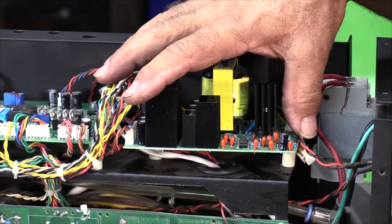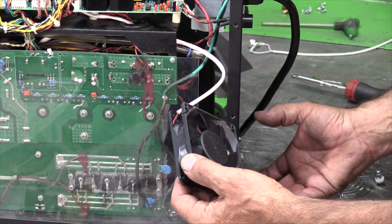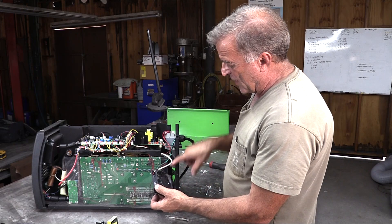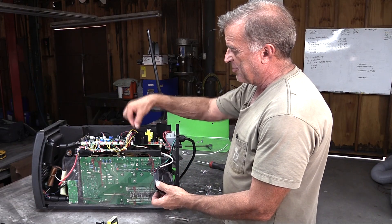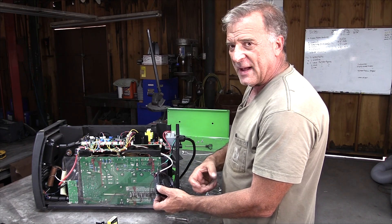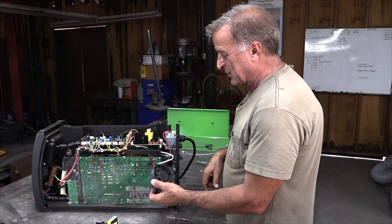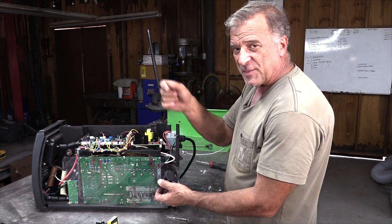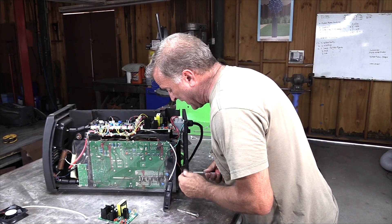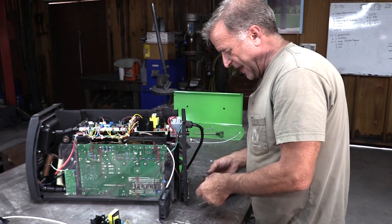This wire just plugs right back in here. This control board will just sit right here for a moment. I'll go ahead and reinstall this fan where it belongs, get the other fan out, then snake that wiring harness out where it plugs in, run it all the way back down through, get the old fan out, put the new fan in, snake it back up, plug it back in. So get your cold drink, turn on your music and watch — let's go ahead and change this fan out now before I put the other one in, and then I'll put the other one back in as well.